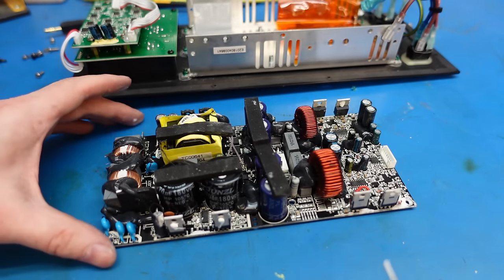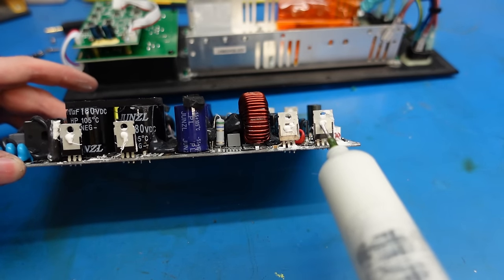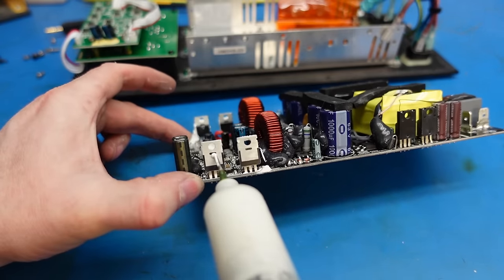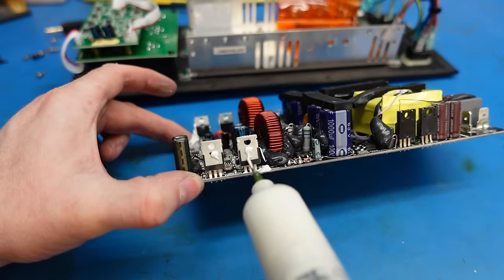Same here for these switch mode power supply diodes — let's check that this Kapton is not got holes in it, it should be good. So what I'm going to do now is just put some fresh heatsink compound on these. It's mucky stuff so I don't like putting much on — just a hair. Same there, doesn't need a lot. I'm just going to use a palette knife to spread it round a bit. It's probably not necessary to be honest.